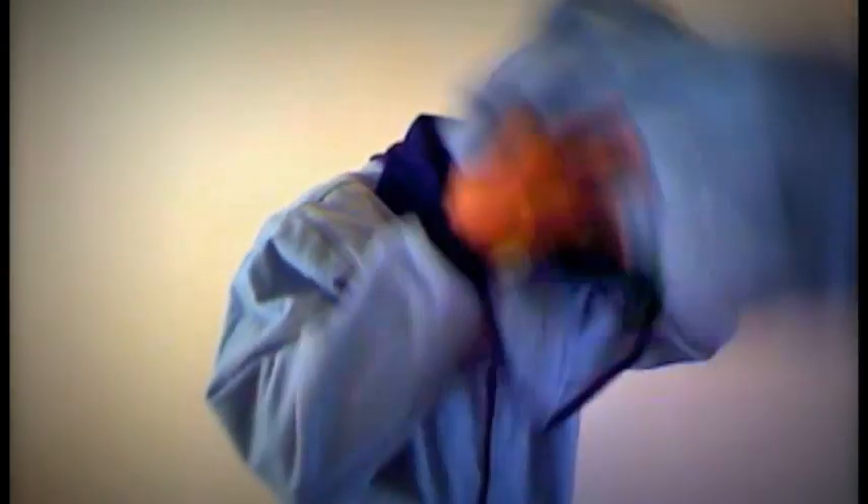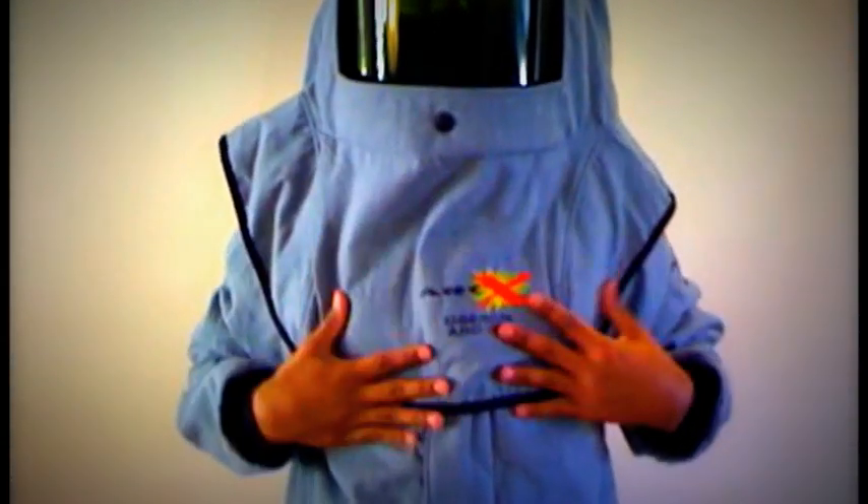You want to make sure that you're properly fitted and comfortable. It sits right on top of the balaclava. You want to make sure that it's completely covered and comes down below your shoulders in the rear — it should cover your shoulders, your neck, and somewhat of your chest up front. As I'm breathing directly onto the face shield, you'll see there's somewhat of a humidity, somewhat of a fog.